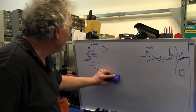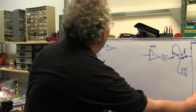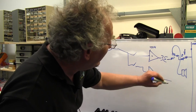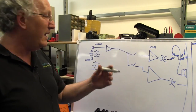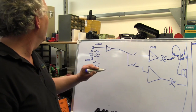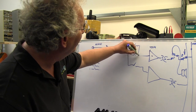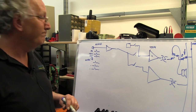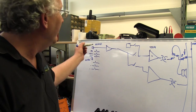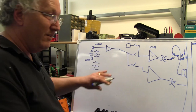The mic preamps have frequency response shaping. We've got all of these various switches so that the output of the mic preamp can be gated through to the intercom amplifier or to the PA amplifier to be sent out to the global PA line. So that electronic switch will run that one. And if they are using that one, it not only gates that through, but it also gets the local 25 kilohertz oscillator and gates it through too. Summed onto the signal, that's it. But you said the bandwidth of this was only 15 kilohertz. For speech. The actual bandwidth of the power amplifier itself is intrinsically much higher. We do the limiting back on the preamp side of things.